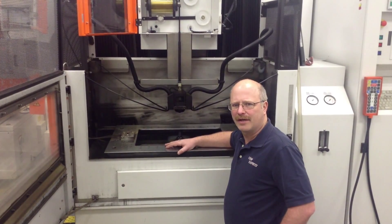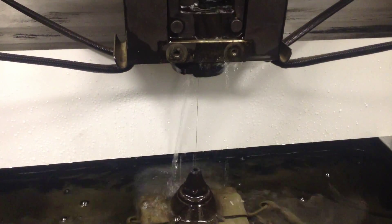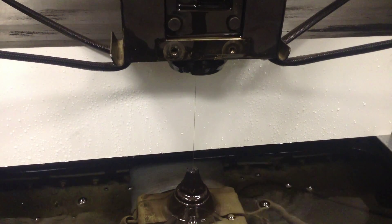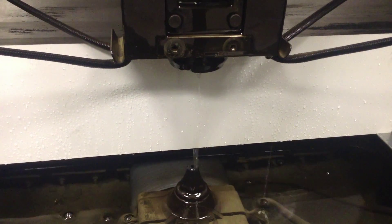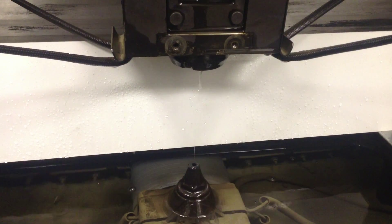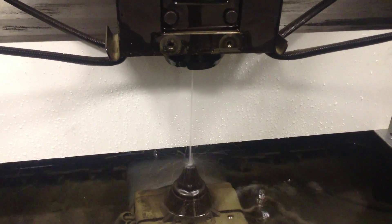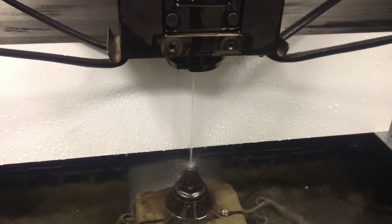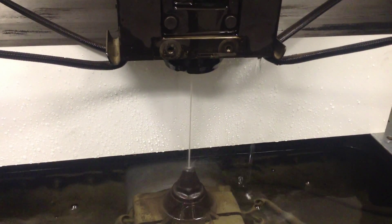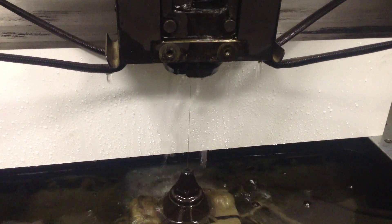Let's take a closer look at this machine cutting and threading the wire. Here you see that the wire is threaded through the machine. When we cut the wire, the machine applies electricity to the wire, stretches it, and then cuts it. There you see the wire is no longer threaded. Now the machine moves to another location and threads the wire. When the threading cycle starts there's a jet of water that guides the wire down into the lower head — and there it is, threaded. That's how a wire EDM machine cuts and threads the wire.